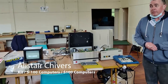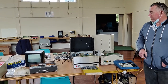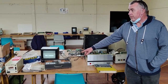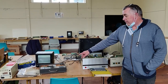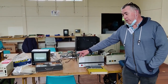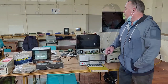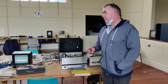Right, so yes, I'm Alistair. I'm his youngest brother. I'm not the one he was talking about who bought the original pet. Okay, that one there is the Dream 6800, which is what I bought secondhand in 1982. Now, it's an Electronics Australia kit set from 1979. The Motorola 6800 IC is what it's using, with 1K of memory, 1K of ROM. And that's what you learn to do your stuff with. So that was my first computer. I probably sold it three times and then got it back. Oh, and when I first got it, the cassette interface didn't work, so you had to type every program out every time.